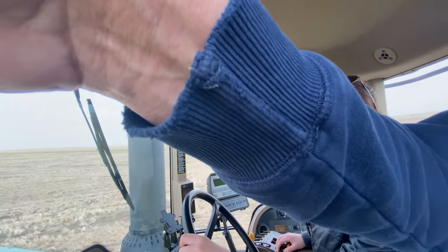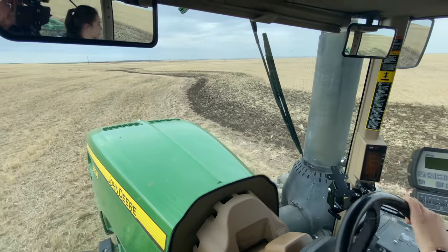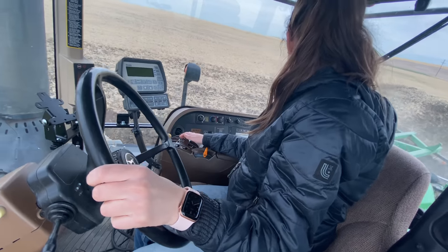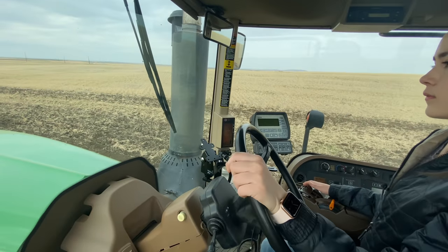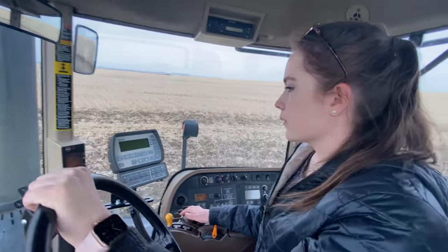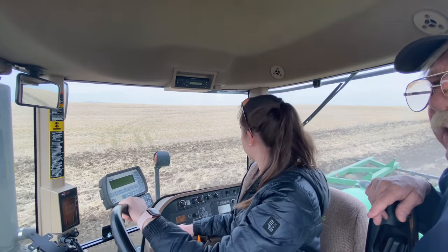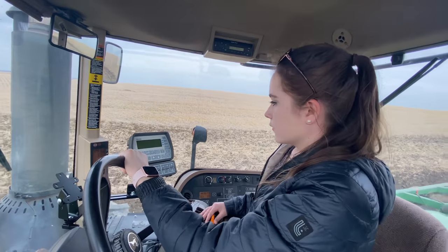Go back over here. Let's catch it right at the edge of that, beyond this brown thing here, because there's nothing here to plow, really. Snug up to the edge there a little bit. Get ready. Not yet. Now get back to your driving. Okay, where are you going? You're okay, but come back now. Stay where you need to be here. You can see where the real valley is, right? Yep. That's where you want that thing in. You better get over there a little bit. Now straight. You're a little deep — straighten out again along the edge. Hold it right here, distance from that hole. Now look back where your disc is. It's about where it needs to be. Bring up the RPM a little bit — you're running a little low.